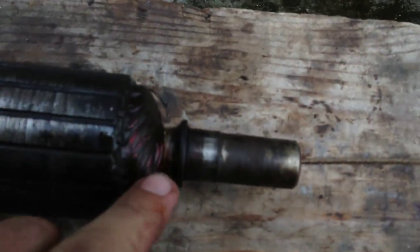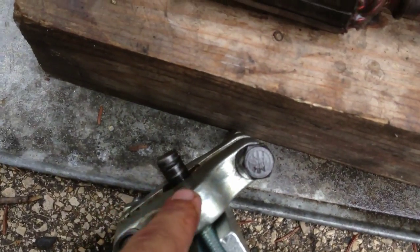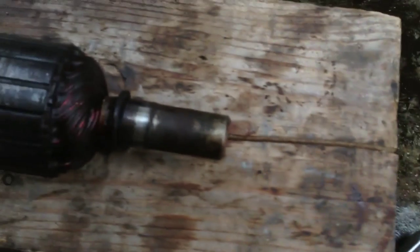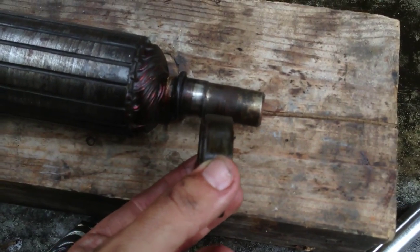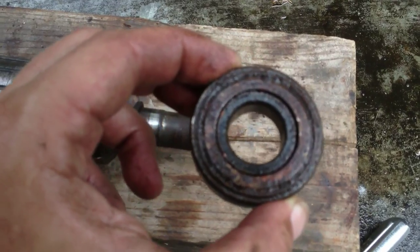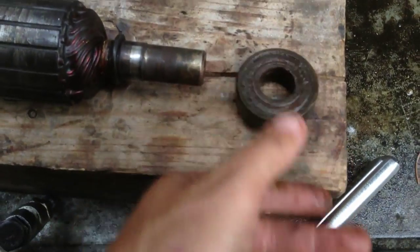Don't do that with armatures — that's not a good thing to do with armatures. So on the shaft there's kind of a little lip. When I put that bearing puller on, I closed it up but tried to not catch that lip. Then I was able to get it to slowly slide and pop it off the end. No identification on it, so I'll have to take this to a bearing shop, have them measure it, and find me a new one like that.